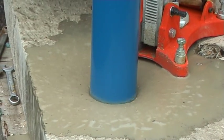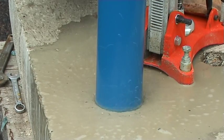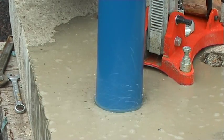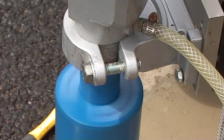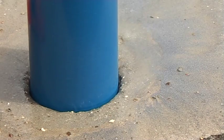The diamond segments used on PDP's wet diamond cores incorporates a state-of-the-art vacuum sintering technology, which supports and holds the diamond grit in the segment for up to 30% longer than standard segments. PDP produce wet diamond cores in stock sizes ranging from 10mm to 500mm in diameter.